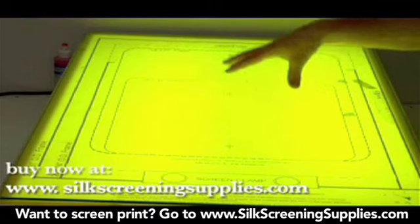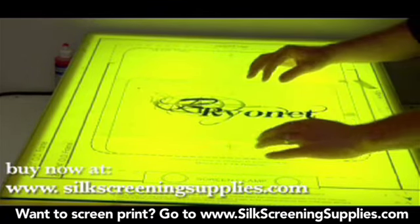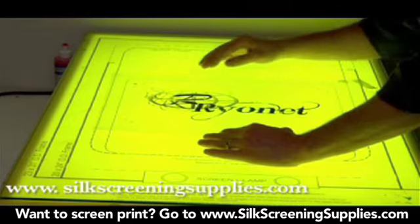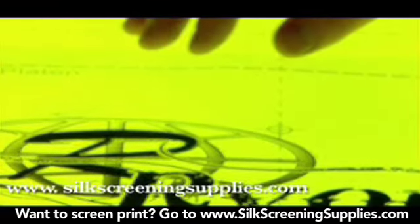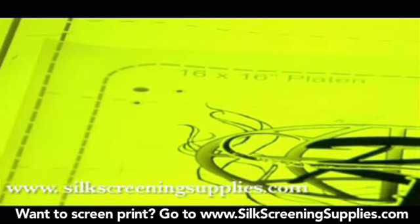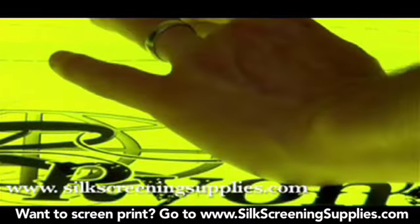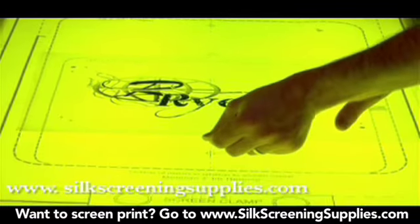To set the second color up for this job, we're going to do the exact same thing. We're going to lay the transparency down. We're going to center the outside registration marks to the horizontal line and the center crop marks to the vertical line. We're going to make sure it's in the same spot and centered. You can either tape the transparency before you put it on or afterwards. If you tape it before you put it on, you don't have to reset the job up.